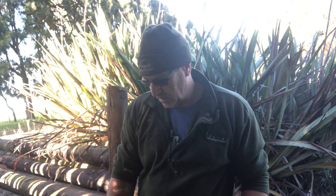So guys, as a fellow lineman, technical manager, and chairman of the SSPG — don't take those risks out there, it's just not worth it. Make sure you do your safety checks; this video shows you exactly why you'd do that. It's just not worth the risk. Go and get something to hold that pole if you've got integrity issues. If it's a larch pole, make sure you're 100% certain, because anywhere through its entire length that pole can rot. Don't take the chances — get home, be safe, enjoy your weekends.